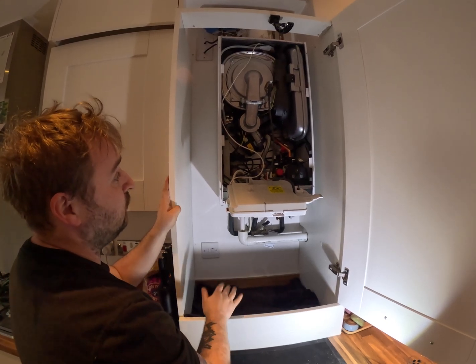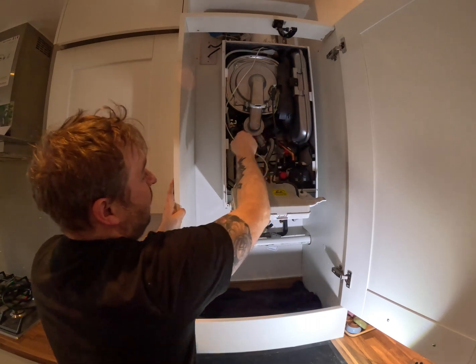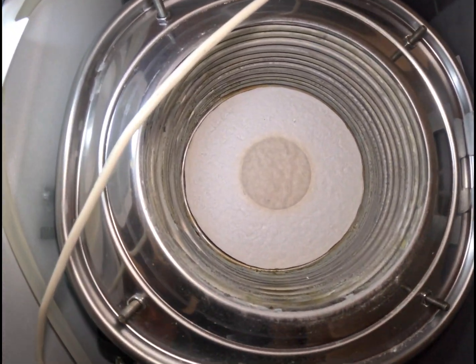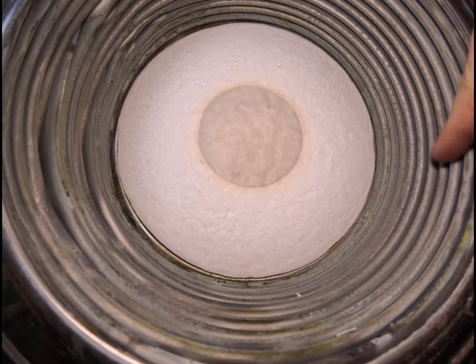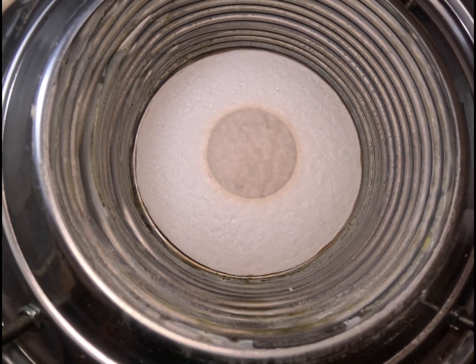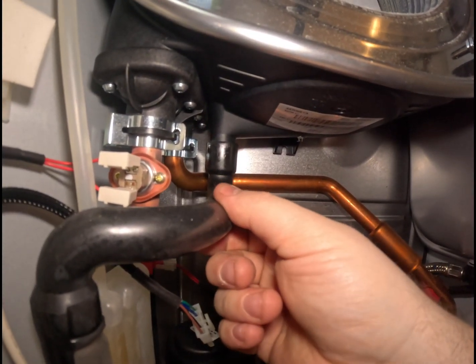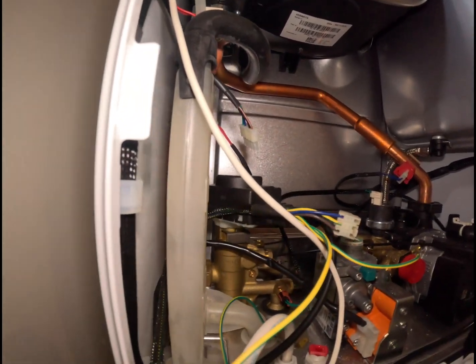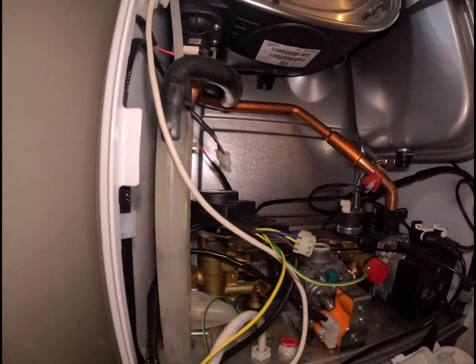Because they're under the same umbrella effectively. So what we're going to do: take out the heat exchanger, give that a clean, drain it down, and pump up the expansion vessel to make sure that's still under pressure. We'll take out the condense and run some safety checks as well. We've got about 18 months' worth of use so it's not too bad, but it will build up over time. We'll clean off the dust and run some water through there. We'll disconnect the condense trap so that any debris doesn't get trapped in it — condense traps are hard to clean out.